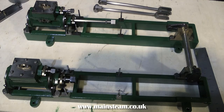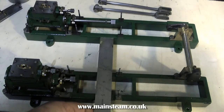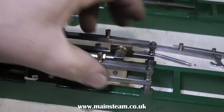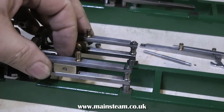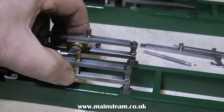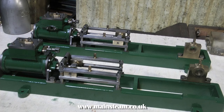Now, flush with success because everything works, it's time to do a dummy run on assembly. Both of these parts need to be the same distance away from each other all the way down. But first, it's a good idea to fit the guide bars. The twin crossheads need to be a good fit in the guide bars with no tight spots — and by no tight spots, I don't mean a rattle fit. The original builder of this engine fitted everything as a rattle fit, mainly due to the fact that the cylinders were not in line with the bed plate. So now I can get a good fit by simply machining a tiny amount off the two middle spacers and using some shim washers underneath.